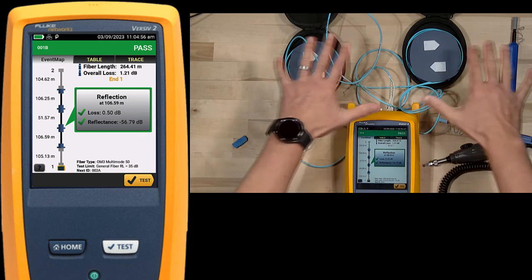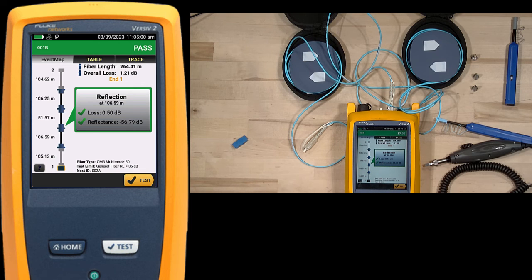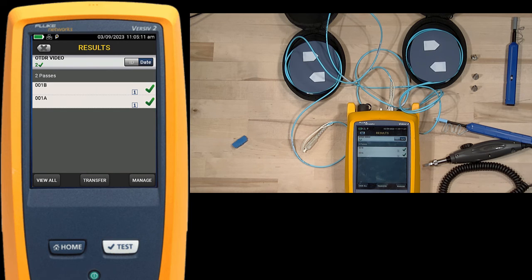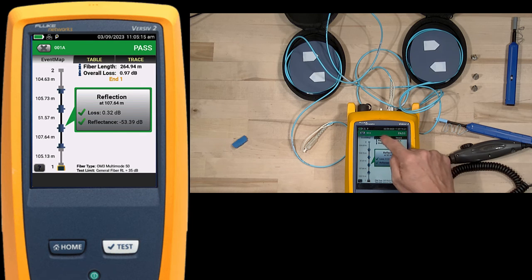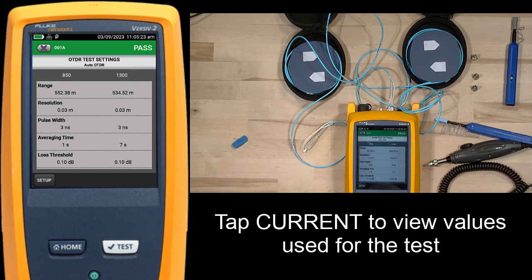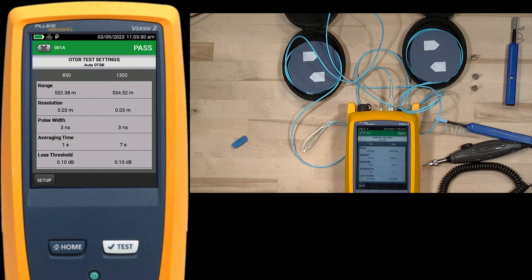This is how we use all of this equipment to set up and do a couple of OTDR shots and take a look at what our connections look like. If I come back out to my home screen and go to results, I can see I've got two passing results. I've set my tester up properly. We can see our trace and what our setup looked like. The results screen shows what values were used for this particular test - our range, resolution, pulse width, averaging time, and loss threshold. So if you want to become an OTDR expert, it's not a bad idea to look at what settings were used to become familiar with the expected values. Thanks for watching - I hope you found it useful in getting the most out of your Fluke Network's OptiFiber Pro module.